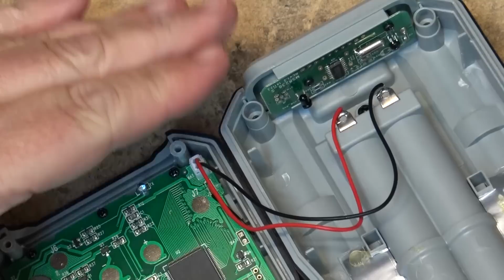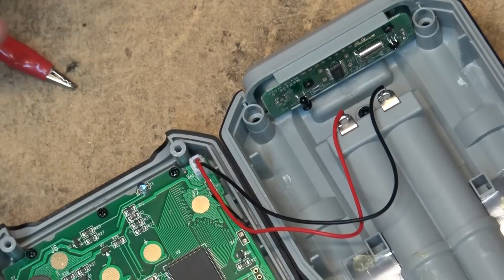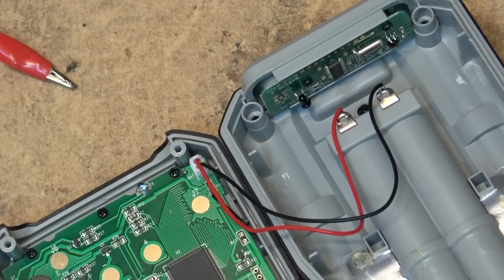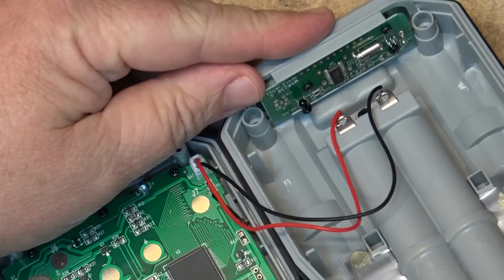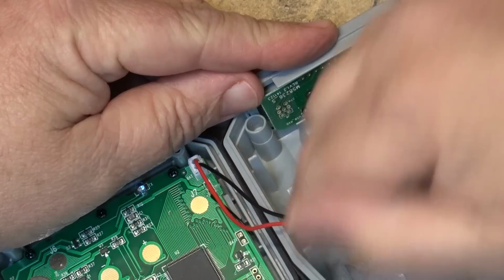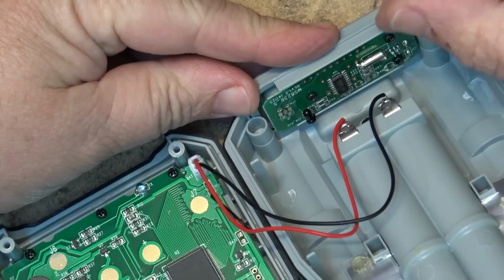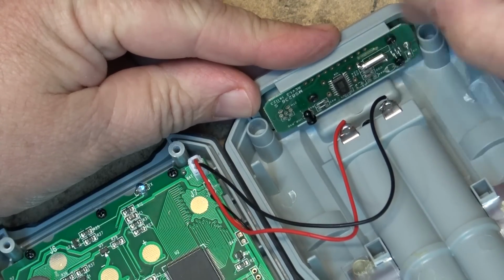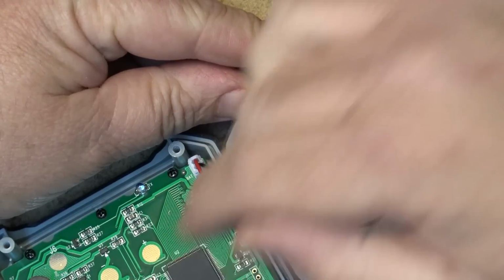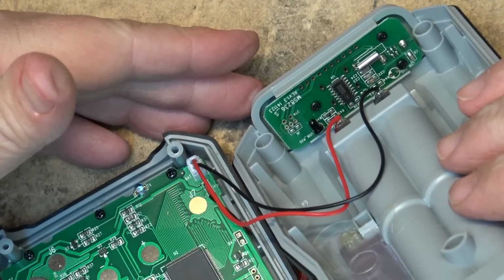We have full isolation of the meter, which is excellent because I didn't expect to see this type of physical isolation. I expected that there was going to be some type of an optocoupler on the board that interfaced to the USB, but until I opened this thing up, I didn't know what it was going to have. But here we have full, complete isolation on separate circuit boards. That's outstanding. That way the meter communicates to the USB output. The computer is powering this up over USB, the interface, and this is just relaying the data from the meter to the USB port. And it doesn't get any better than that as far as isolation goes.